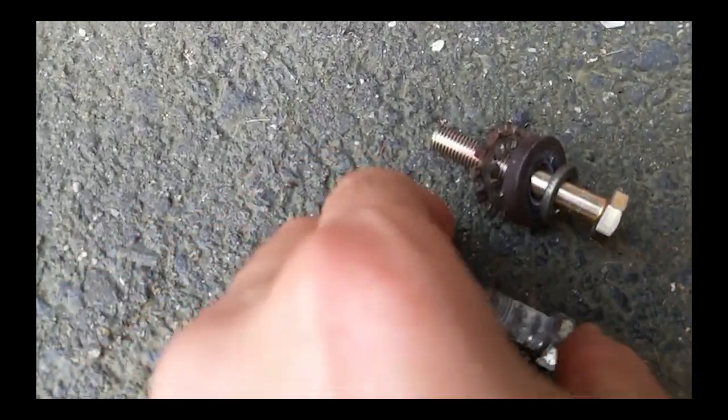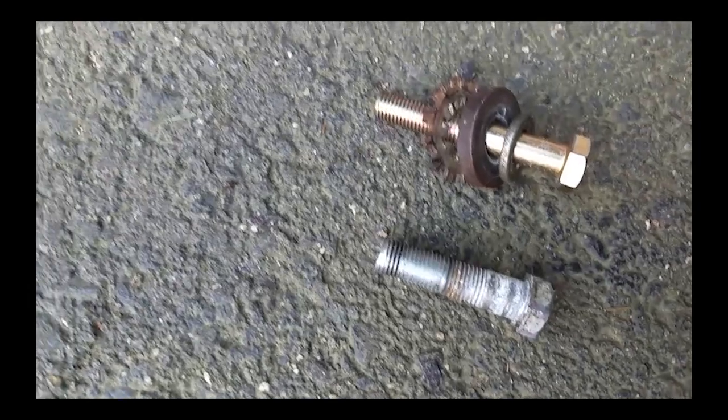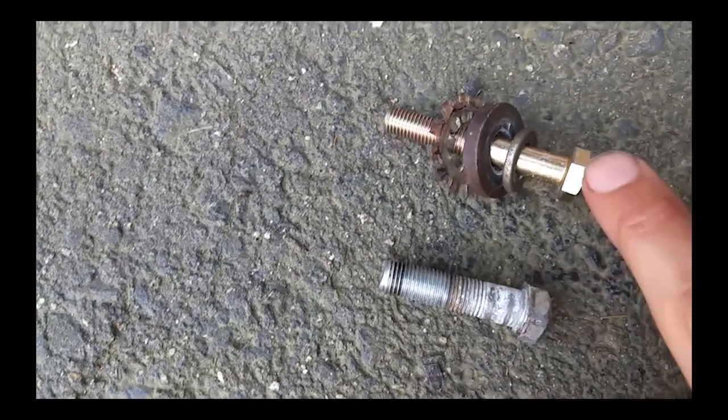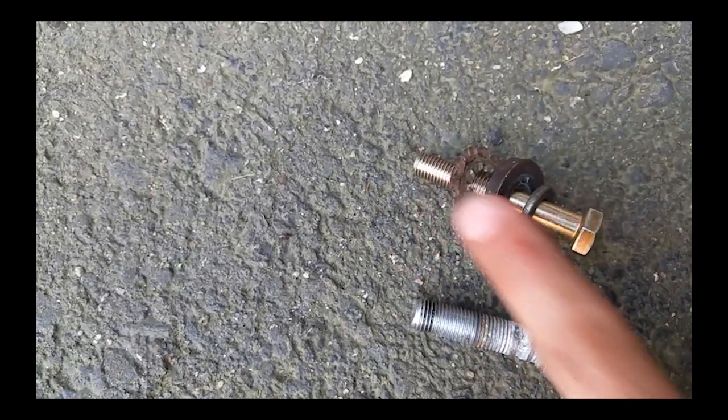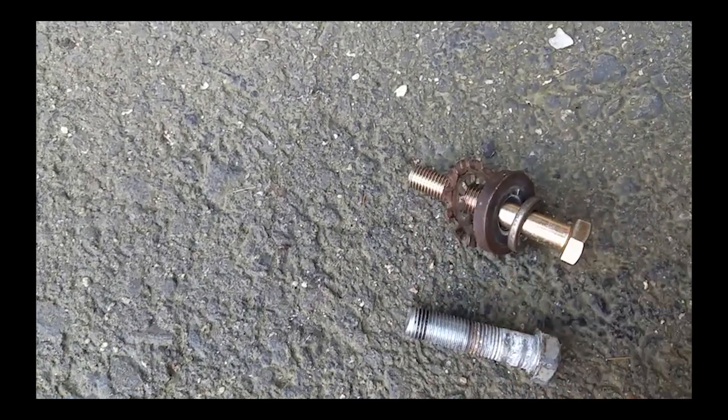I checked the distance from the cage to the impeller and it's good — about a quarter inch, a little over, and I've got about a quarter inch between the impeller and the front metal as well. It's centered in there pretty well. I had to pick up a new bolt — compared to the old one, the one-inch shaft uses a 5/16 bolt with 24 thread, versus the three-quarter inch shaft bolt. I put the original parts back on, so this is ready to install.